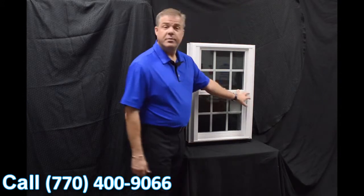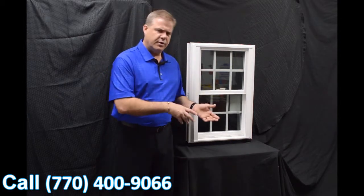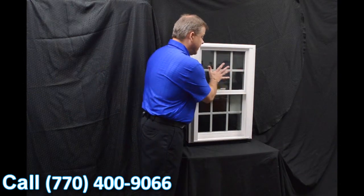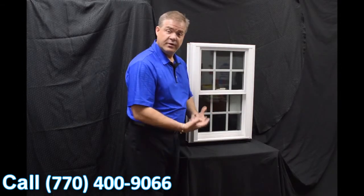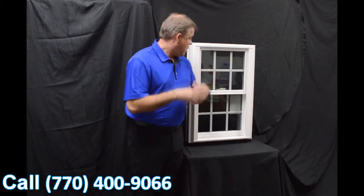With this window, it just blends into the house perfectly. The next item I wanted to talk about is the exterior glazing bead. A lot of companies use interior glazing systems, but we went with an exterior bead. The philosophy is: the harder the wind blows against the outside of the glass, the tighter that inside seal becomes.